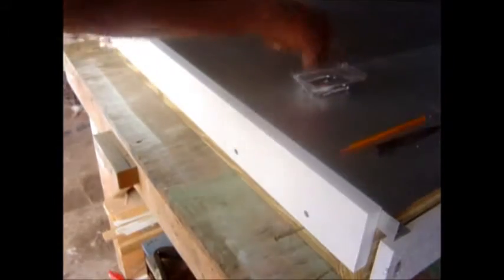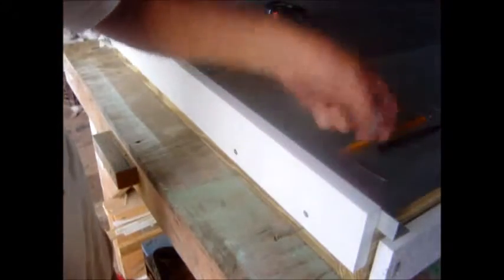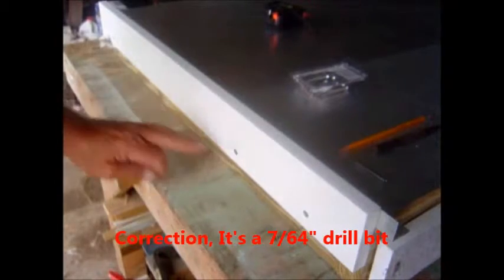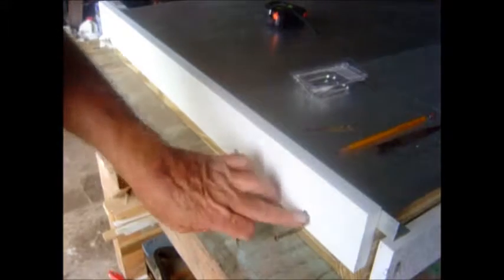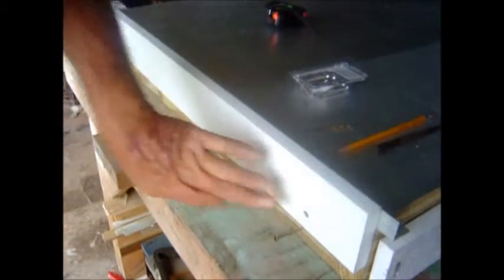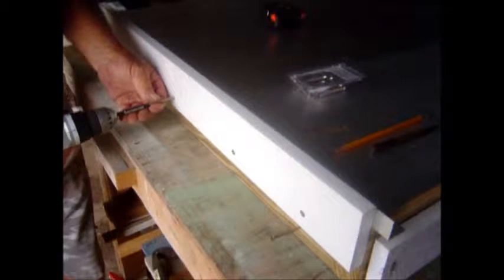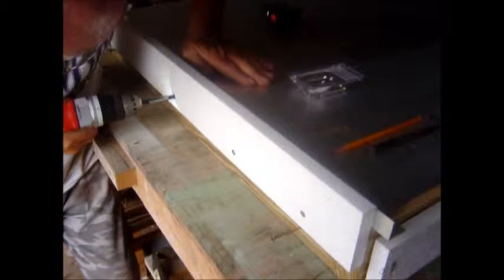The pilot holes — I'm drilling these. These are number 10 stainless steel Phillips head screws, and this is a 7/32nds bit. I drilled this through all the way through the wood and the PVC, which provides a pilot hole for easier screwing. I found out these stainless steel screws, especially the Phillips head type, are real soft and you can wring the head out real easy — that's why I'm putting a pilot hole in. Once you sink the screws in, they sink right in, perfect. They sink into the wood, excellent. I'll continue with this and get both of these sides on.